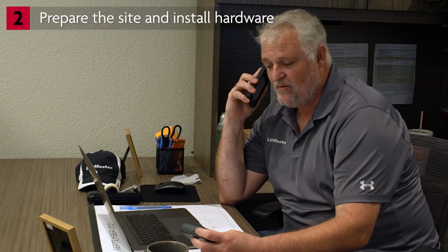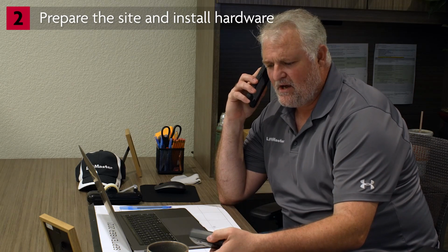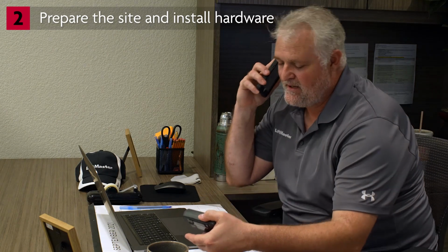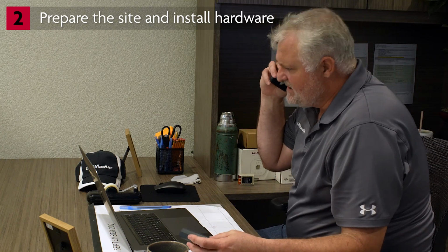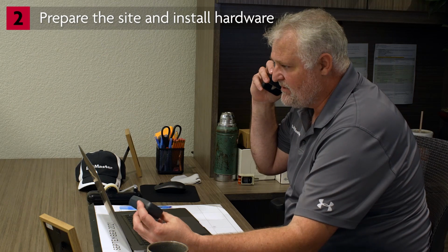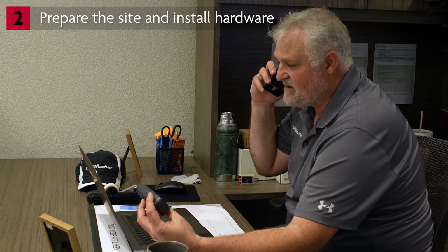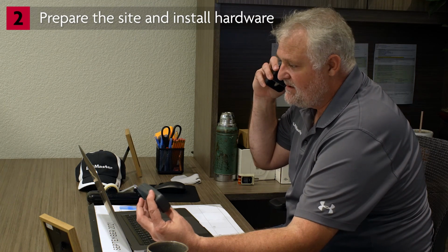Find out if there is a network firewall. If there is, you may need additional assistance from Clopay Support to configure the setup. Confirm the number of doors being set up. If more than 32 operators are being installed, you'll need to contact Clopay Support for additional assistance configuring the setup.